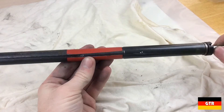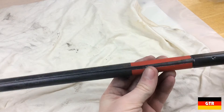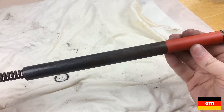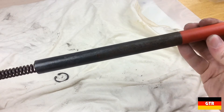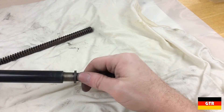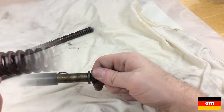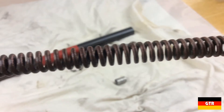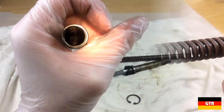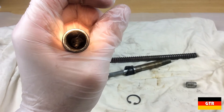There was a very small amount of surface rust on the latter half of the spring sleeve — nothing really to worry about. One end of the spring sleeve is threaded for the adjustment screw. When you adjust the screw, you're actually moving this sleeve towards the front of the wrench, which compresses the spring. The brown material on the spring is actually anti-seize lubricant which hasn't dried out yet, so I'm not even going to worry about cleaning it off. After we take the torque adjustment screw off, we can see how the unit is calibrated — down in the shaft is a slotted screw that changes the starting position of the spring.